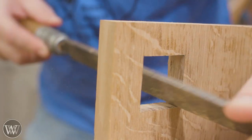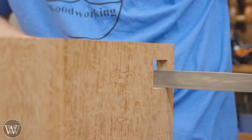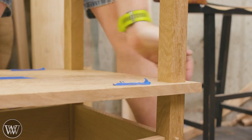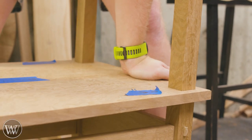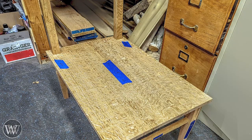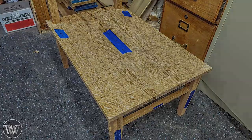It's kind of nice to come in with a file and clean up any burrs or edges that are coming out, any splinters that are coming off. We want to make sure the top edge of this has a nice crisp edge because the top edge is what you'll see — the bottom edge, if there's any gaps on that, no problem at all. Now here I want to be very careful when sliding it all the way down, supporting with my hand so that it all comes down nice and easy. And there — that's where we're going to get from this one. Oh man, I'm in love with this top. This is going to be a fun build.